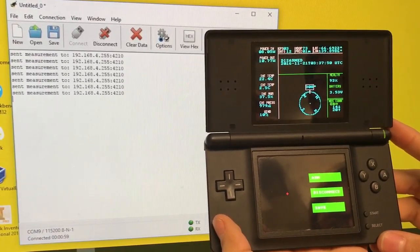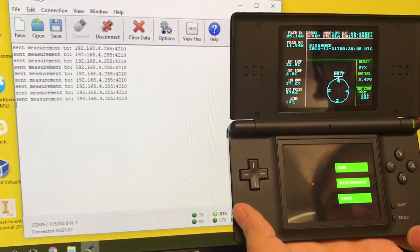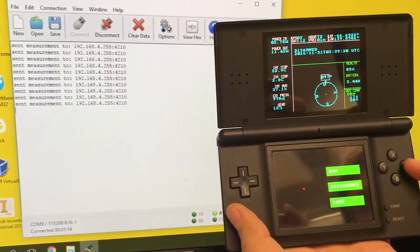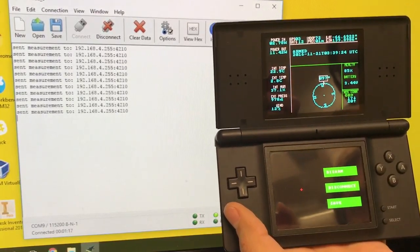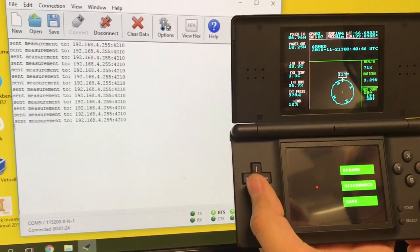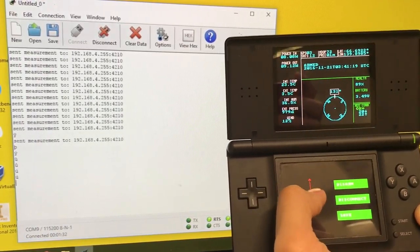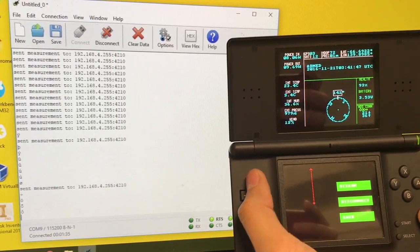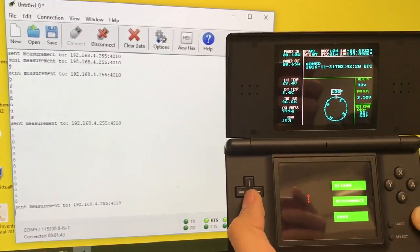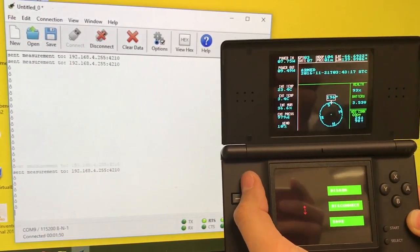So how would this look if we sent the data via the Nintendo DS over Wi-Fi to the virtual rover — that is the computer right now — this serial terminal that you see on the left? To do so, we just arm the Nintendo DS, and now it will accept and forward any control input. So to send control input, I would just use the D-pad. You can see as the arrow is growing here, on the left you see kind of these garbage characters — those are just two bytes interpreted in ASCII — sent over Wi-Fi from the Nintendo DS.